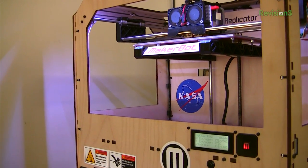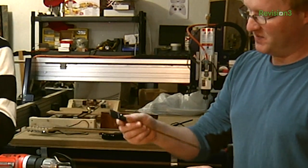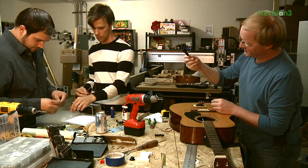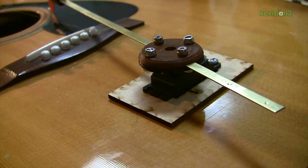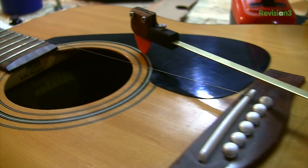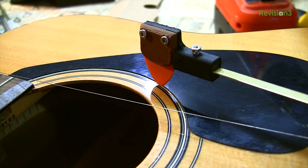I'm working on the pick holder. This is a black piece of plastic that I 3D printed with a set screw, which sets onto the actuator arm. Then I printed a tan piece that will hold the pick in — it'll have set screws so it'll be adjustable. They can put in different thicknesses of picks based on whatever style of music they're playing.